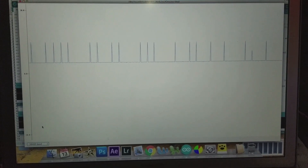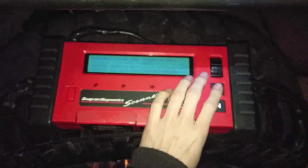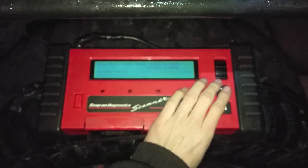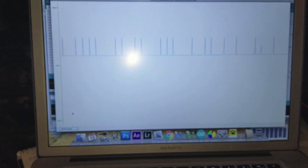I wonder if we can do that with the TX pin on the transmission. I added a pin for the transmission output and switched the pin so it's feeding to the correct line. Going into the scanner: other systems, transmission, codes and data — it's scanning. Now we plug this in, and if it comes alive we may get something.